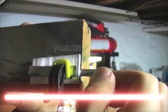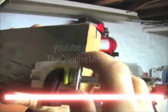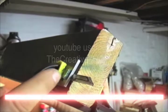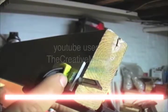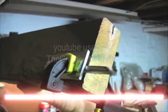What's good about this is that any heat that gets transferred is going to go to these bigger plates, and it's going to take a while to heat these up. If you were to place this clamp directly onto your aluminum fin, the plastic on the clamp is going to melt, and you don't want that. As you can see by this little notch in my clamp, I've done that before, and it already started to melt. So use these aluminum pieces as heat sinks.